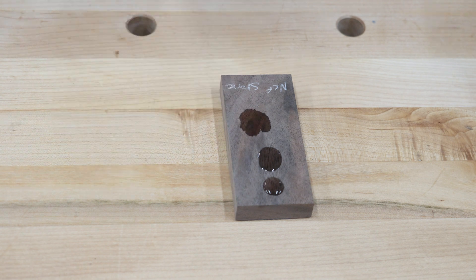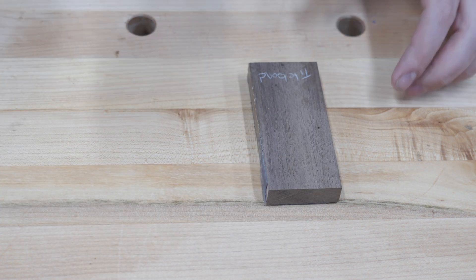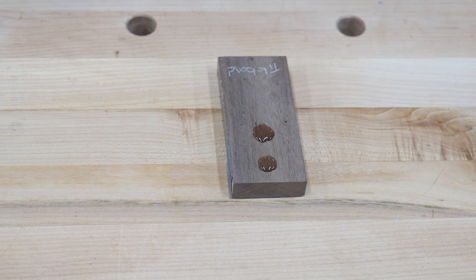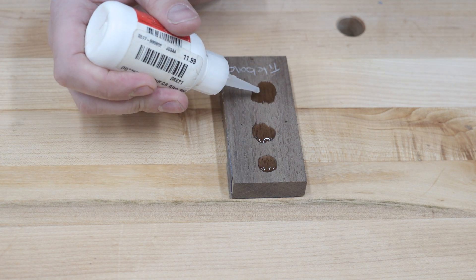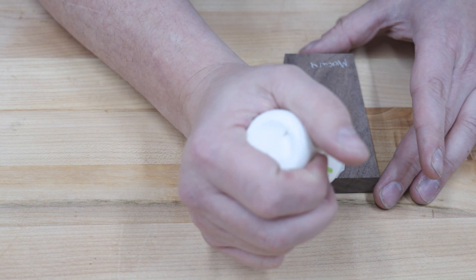Next up, using the same process with NCF Stone. This one probably looked the best but it took forever to cure, so it's not really a useful application — and again it's designed for stone, not wood. The Titebond had very similar results to the NCF Quick, although with the thin it did bloom significantly more. The medium and thick however looked relatively similar — there were some bubbles but it didn't actually bloom.